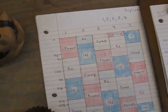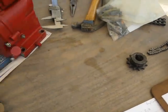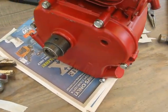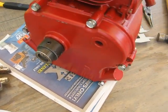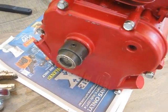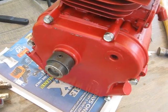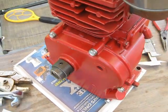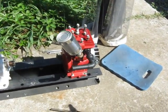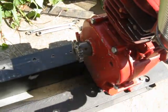At the moment I'm taking off the rear sprockets on the engines and modifying the phasing — or clocking — of them to suit the five cylinder configuration, then welding the sprockets back on. That's what I've got set up over here. I've got number one cylinder done.